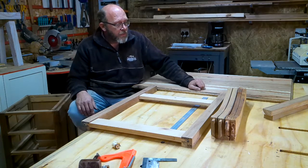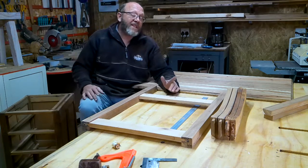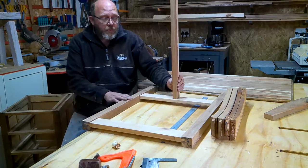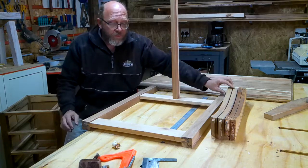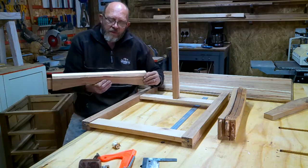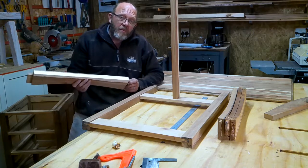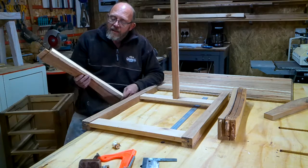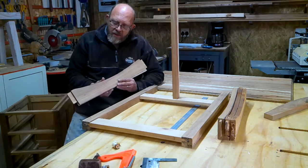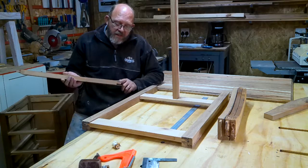on the tabletop. I've remade the two pieces, or the three pieces actually, if you take this one in consideration, that comes between the leg part and the drawbox, plus the two that's gonna go there on top. I remade these because those were very thin, broken, and it was made from Maranti. So I made them from Kiaat now. Still lots of sanding to do, routering to do, to round over this edge, because this is where your legs is gonna go past. I've done the tenons.